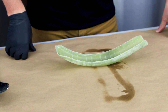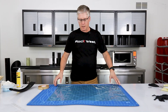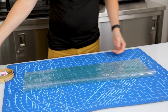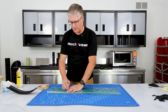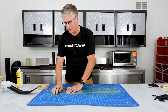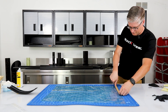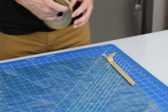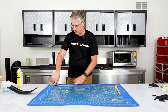We'll spray a light coat on the entire surface. That's my second coat — I'll put another coat on and then we'll start laying up. While we're waiting for the release agent to flash off, I want to demonstrate how to make a bag. We're going to make an envelope bag that we'll slide our part into to cure it. You need to make sure your edges are fairly straight or you'll have a hard time lining up your tape. I'm only going to close off two sides to start with so I can slide my part in.